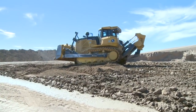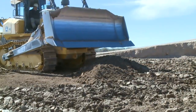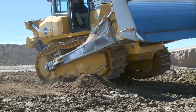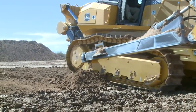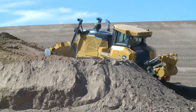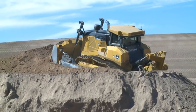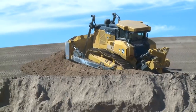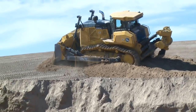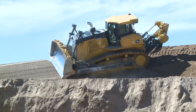You should also reduce your speed when in rough terrain to help you maintain control of the unit. Cross over obstructions at an angle. Ease up to the break-over point. Balance slowly on the obstruction and ease down to minimize the impact. On steep slopes, work diagonally, starting from the base of the slope working upwards. The hydrostatic transmission for each track provides constant power even when turning, so steering on a slope is the same as steering on flatter ground.